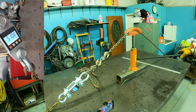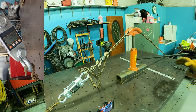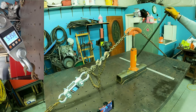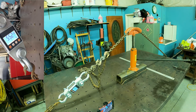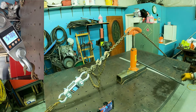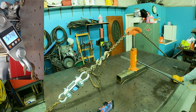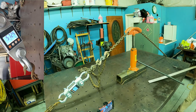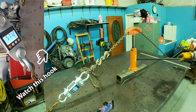The jack's bleeding off — there's 5,100. Apparently my seals on the jack are not great because it's bleeding down. 5,000 pounds — I no longer have a hump side to side. Going to 5,500. 5,524 — everything's still intact. I'm sure I'm right at the limit of this chain. Let's see if we can get 5,750. Sounding crappy, I don't like it, I'm nervous. 5,750 — I'm starting to get a gap between the straight edge and the table in the middle, so I've completely overcome the hump. Let's go to 6,000.